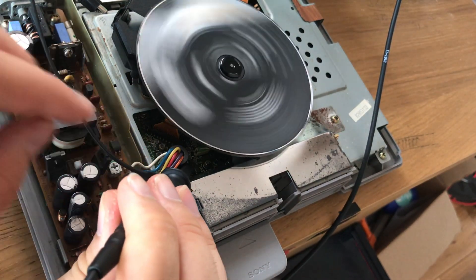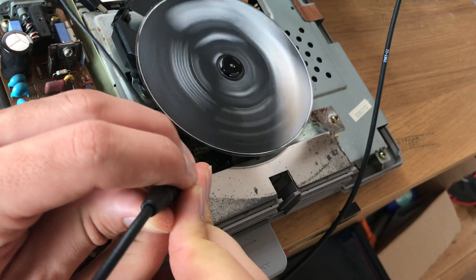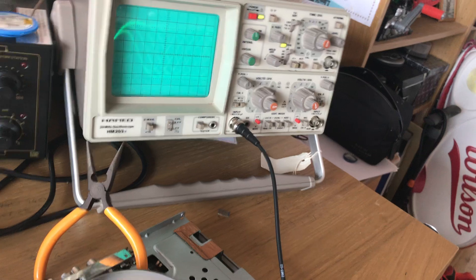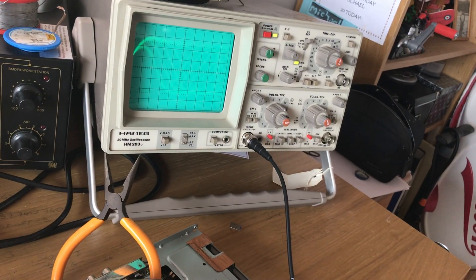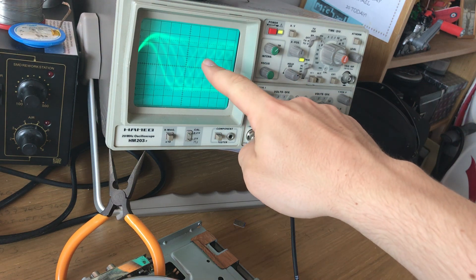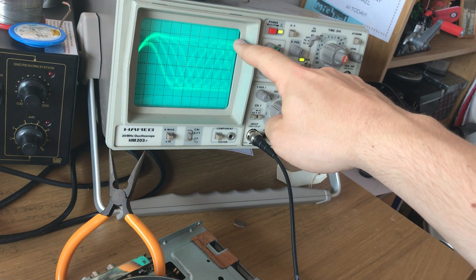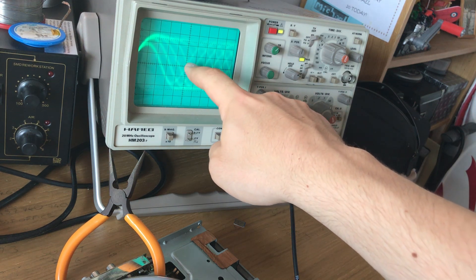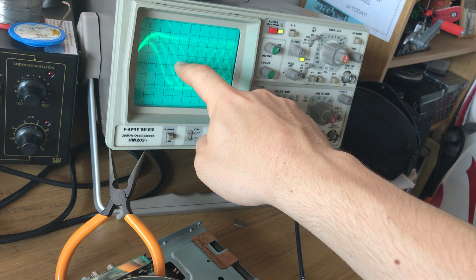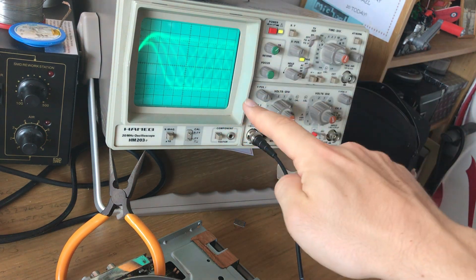Going in here to CL704 carefully, not touching the CD — and there's our eye pattern. I'll turn the intensity up a little bit so we can see it better. This eye pattern is hardly perfect, but it's about the best I was able to do. You want to adjust your focus and tracking gain to minimize the up-and-down jittering, and also make sure the image is as sharp as you can get it. If it's blurry or there are bits missing, that means you need to adjust the focus and tracking gain.